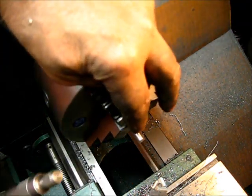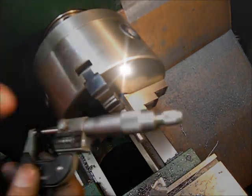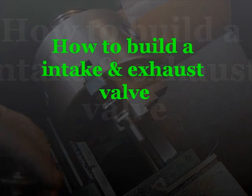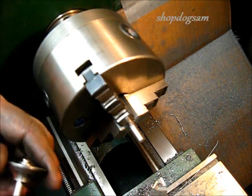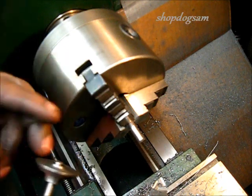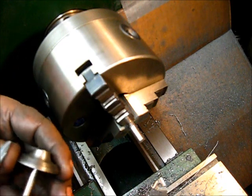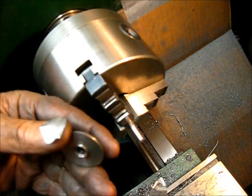Turning to shoulder, the measurement is 284. I did find out that the drill bit did not drill the hole in these valve heads the same. There will be a thousandths or so difference in the drill bit runout, to get a press fit.